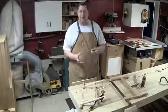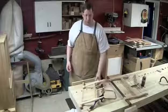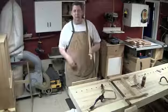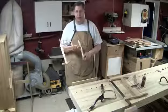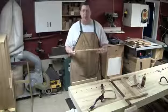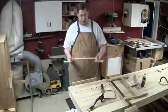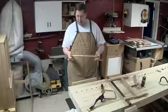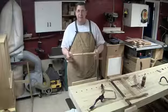The coping saw is still a really effective tool, but you can see it has a smaller blade — generally about six inches. If you're working on full-size furniture pieces and cutting curves by hand, the turning saw is really the way to go. The 12-inch span is excellent. The Gramercy model is made out of hickory, so it's very lightweight yet very strong.